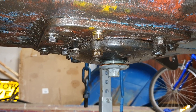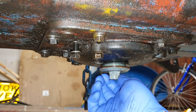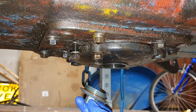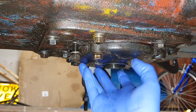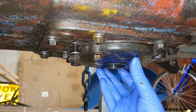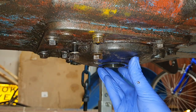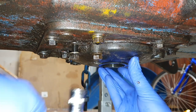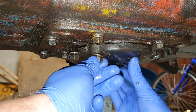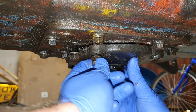I've loosened a few things off just to shorten the video. Here's the hydraulic drain cap or drain plug with a beautiful copper washer. Then you've got this cover plate, held in by four bolts — I've undone three of them. These are five-eighths bolts. Being on a tractor they are going to be oily. I recommend doing a gasket replacement whenever you undo this stuff because they are going to be fairly soaked.